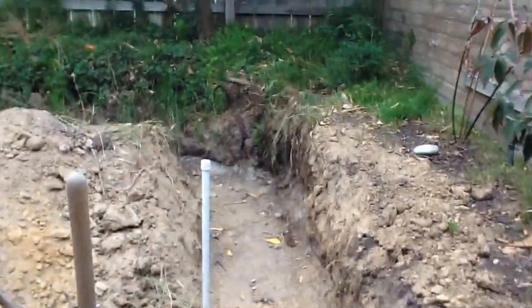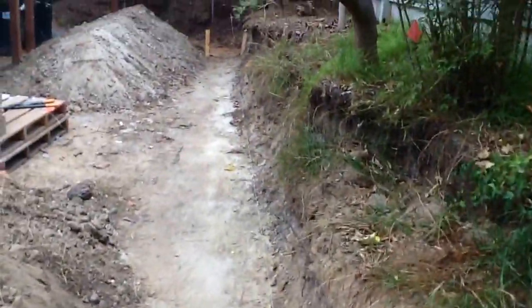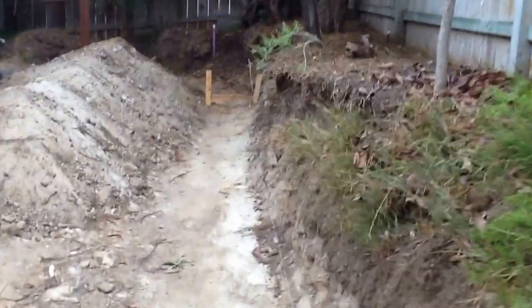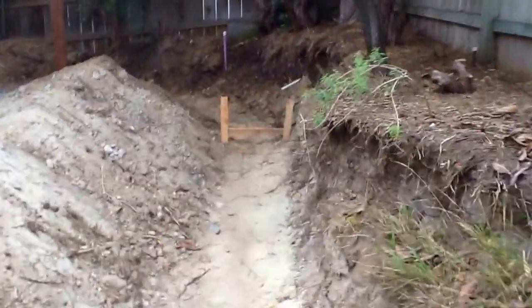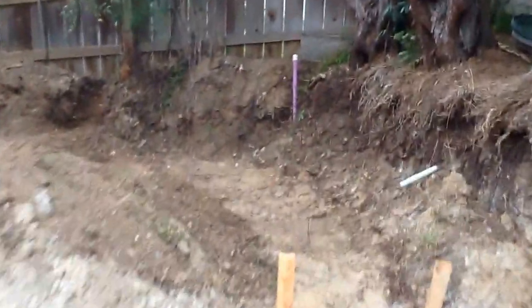The ground is nice and level and all tamped down and ready for that all-important first course of bricks. See the batter boards? The line is at the exact right height for the first course, so all I have to do is put the edge of the brick to the line and then plop down the next one. This is one of several improvements that I made in my building process for the retaining wall that makes things go faster.